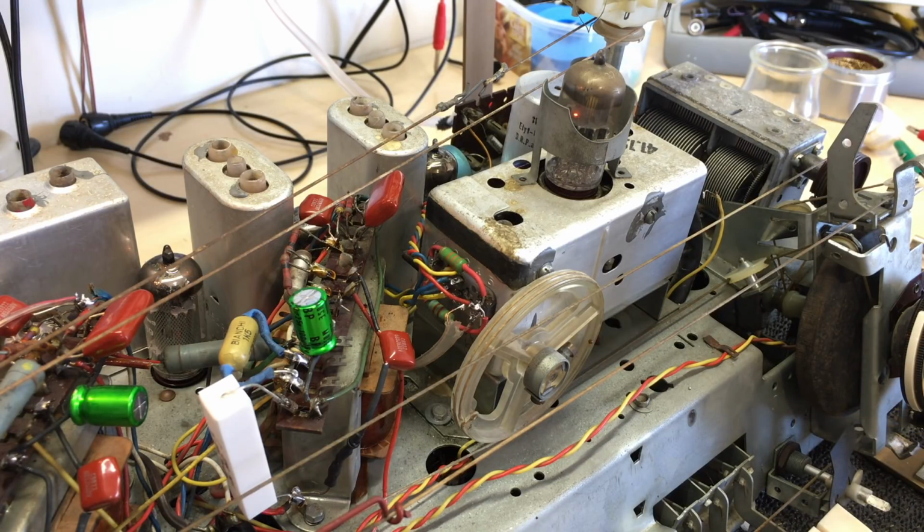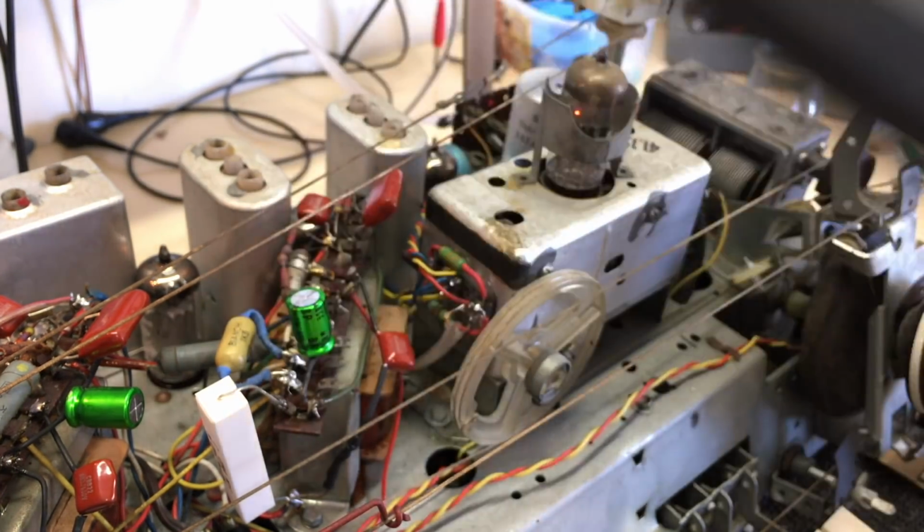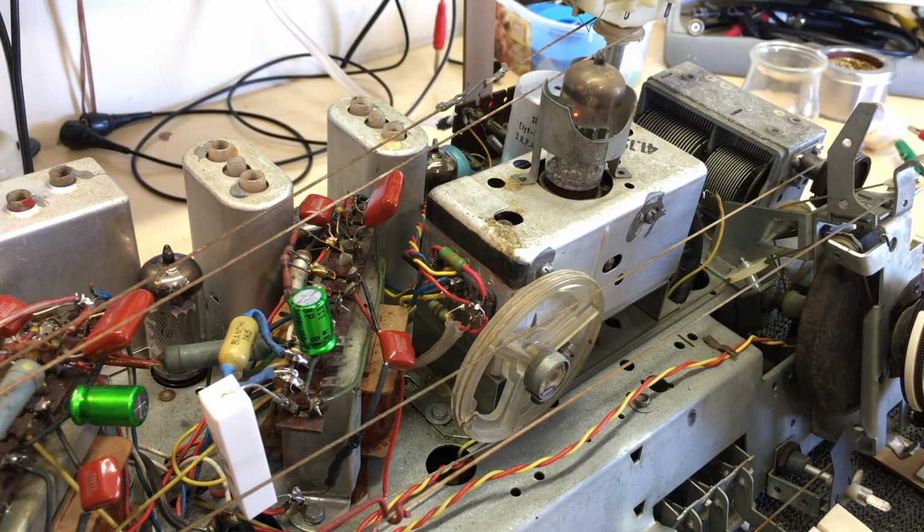And the reason this thing is so off the charts in terms of RF alignment is because when I removed the components in there to check them, values change. I do measure, for example, a little trimmer cap. Take note of what value I read. Let's say these things are 0.5 to 3.5 picofarads, and the instrument I'm using is this guy here, which is fairly accurate, but it's not absolutely accurate. But I'll measure what capacitance this thing is set to. I'll then twiddle it to make sure that it's functioning as a trimmer, and then I'll put it back to the original setting that I'd made a note of, and I will solder it back.